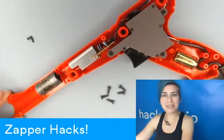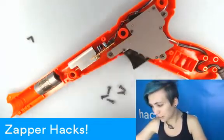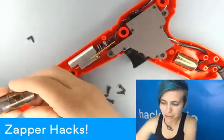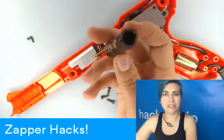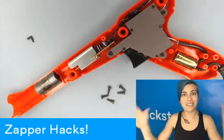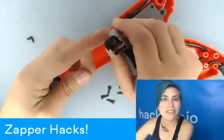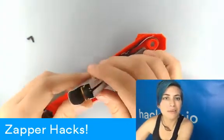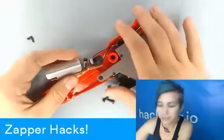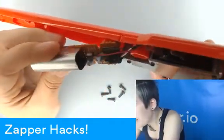This is so gorgeous — I love this thing. One of the cool things about this is it has, just for heft, this metal weight in here. It's not connected to anything, it just looks like a lump of metal. There's also another piece here — I think it's just another weight too, not hooked up to anything. So they thought a lot about how this would actually feel, and I love seeing those details beyond just the electronic circuitry. Then you get to this piece, which is the light sensor assembly. There's a little LED-type deal in there, some capacitors, cables going to it, a transistor — just a whole sensor rig, and it's actually quite well-labeled.